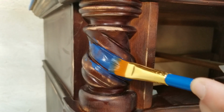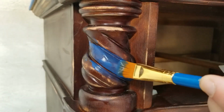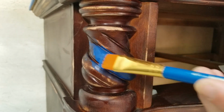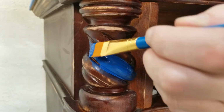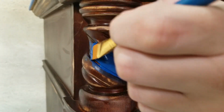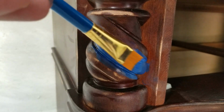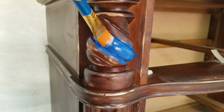As I mentioned before, whenever you're sanding, you want to make sure that you avoid exposing the raw wood as much as possible so that you can avoid bleeds. Bleeds are stains that show up in the paint after you've applied it to a wood surface. It's basically the oils in the wood or the wood stain interacting with the water-based paint whenever it dries up. Normally the areas that you've oversanded will have stains show up in the paint, but this doesn't happen with all wood. So one of the things you can do to see if your furniture is going to bleed is to just test a little spot.